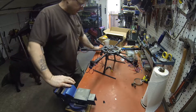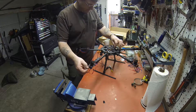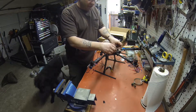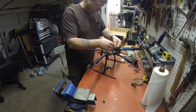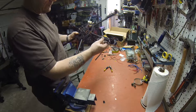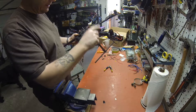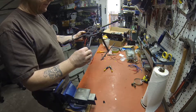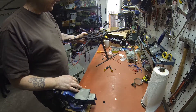We got it all finished. I pulled the control wires from the ESCs back through the arms — the first one went perfect and then the rest were a real pain, but I got them all through. I remembered to number them because once I put the mid-span deck on, it'll be harder to tell which one's coming from where. The ESCs are mounted, control wires are pulled through, and ESCs are hooked up from the battery lead back into the motor. I've still got to put the hub tops on the motors for the props. The mid-span deck is ready, and I'm ready for electronic components, finishing it up, and starting programming.